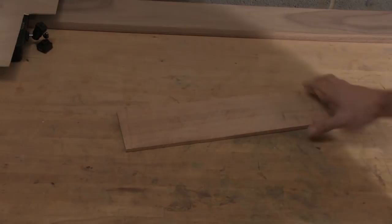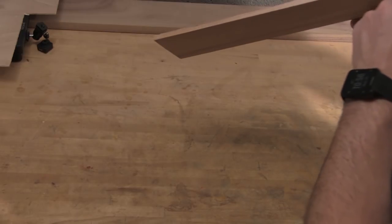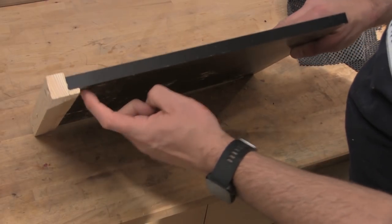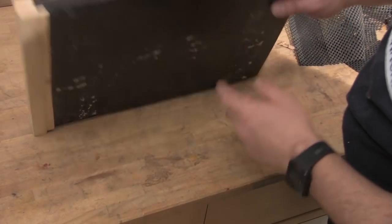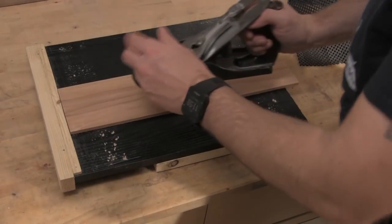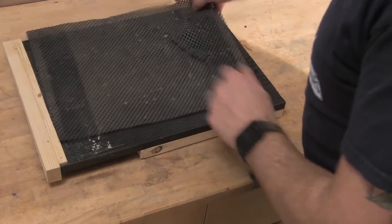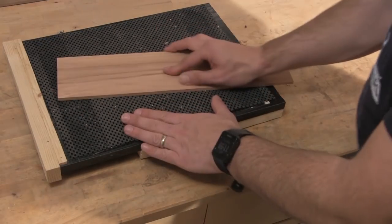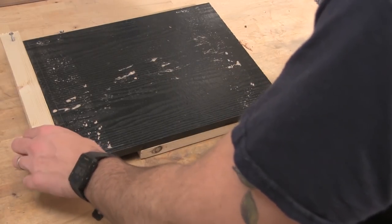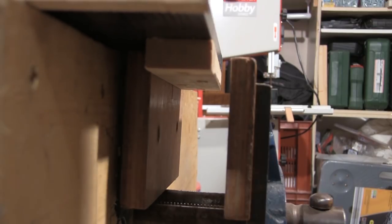This process has left a lot of rough and ugly saw marks along the length of the cut, and despite my best efforts the saw did drift away from the mark from time to time. So I need to neaten them up and I'm going to use a little jig to do some planing. Using this jig I butt the work against the edge, which allows me to plane without the job moving. The silicone matting is pretty good at stopping the job from sliding around. Sometimes I prefer to use double-sided tape. The jig has extension pieces for different heights of board, and a rail along the edge that clamps in my vise to keep everything steady.